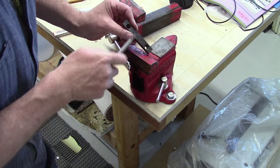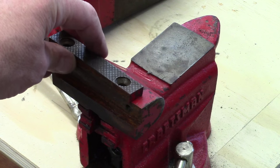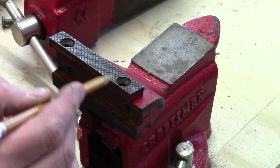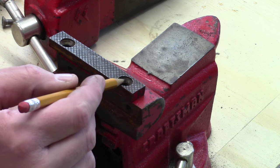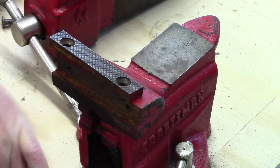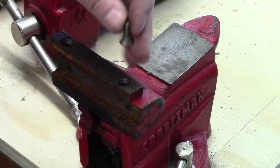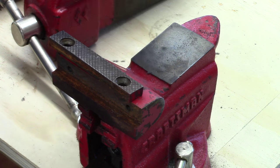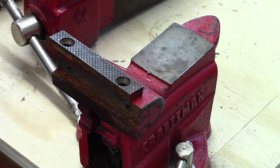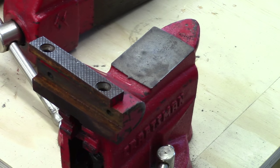Let's take a look — yeah, you can see here there's a little lip in addition to the countersink. What we can do is just go extra deep with the countersink that way, which allows a little bit of room for wear, and just drop the screw so it sits down about a sixteenth of an inch or so. Pretty simple, shouldn't take very long. Not a huge amount of machining on these.